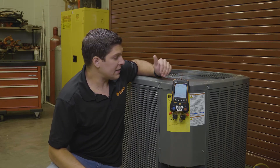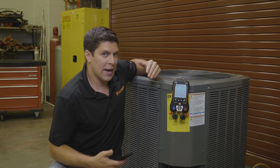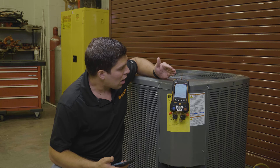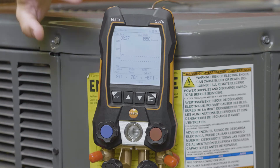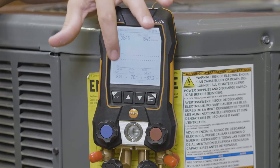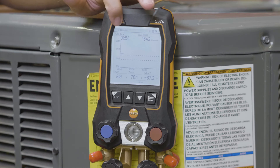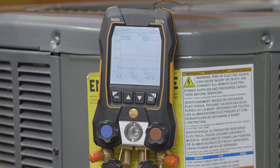We're getting closer to our maximum decay target. I did adjust it from the very beginning — we had it down to 1,500, which is the factory setting from Testo, but for demonstration purposes I wanted to show how the graph and target lines work. You've got the big display showing everything live: your temperatures, internals, ambient temperature, delta temperatures, your timer, and then also your 552i connected giving your micron readings all live.